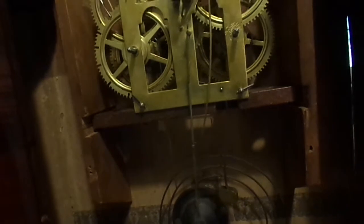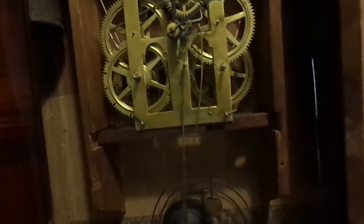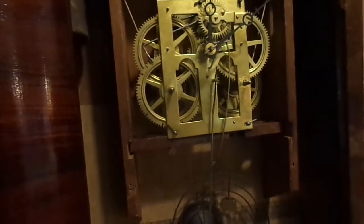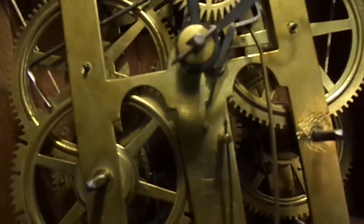In Chauncey Boardman's factory I had another Boardman clock movement — the one sitting apart on that table — that had the same problem, and it's about a year or two newer. Maybe Boardman had that defect in a couple of his mechanisms. I'm not going to run the strike train right now because I have it set where I need it. It strikes fine, it ticks fine — it's all final minor adjustments. I think this clock will do okay, but only time will tell.